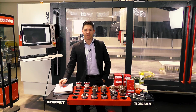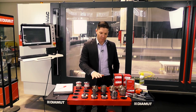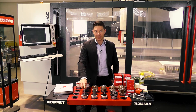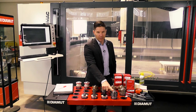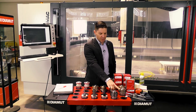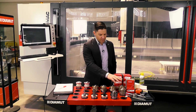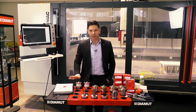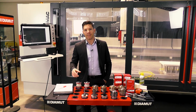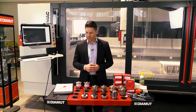We're going to get started on taking some measurements on our tools. We've set them out, so we'll go right through everything. We've got a blind hole drill, our core bit, our finger bit, our Super Z, our power edge, our position one diamond which is a segmented diamond, and then we've got continuous rim diamonds for positions two, three, four, and five, and our two polish wheels. We're going to go through exactly what diameters and lengths we want to capture off of these tools.